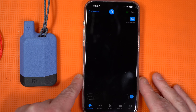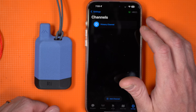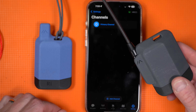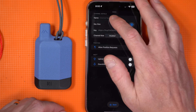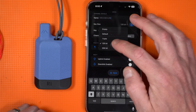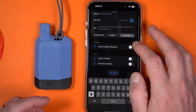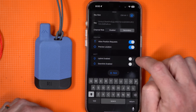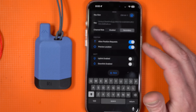To go a little further, let's create a secondary channel. You may want encrypted channels — and yes, it does support encryption. Keep in mind that when there are channel options, always leave your primary channel alone, particularly if you're running a standard client that rebroadcasts packets. If you want a secure channel, click 'add,' name it — for example, HRCC Secure — then set it to 256-bit encryption if you want (128 is okay too), and cycle through a number of keys. You can enable position requests, precise location since it's encrypted, and leave MQTT off. Then hit save.